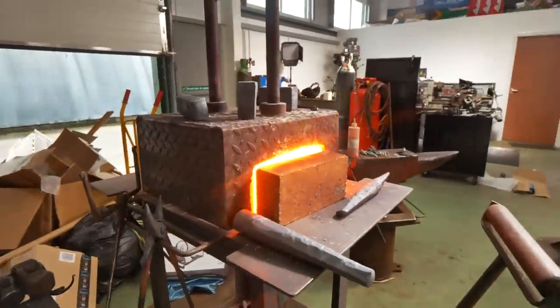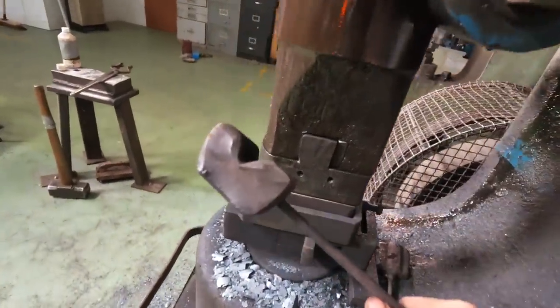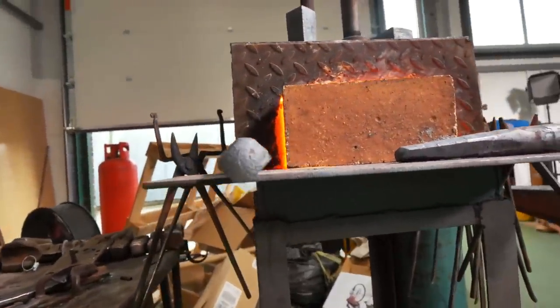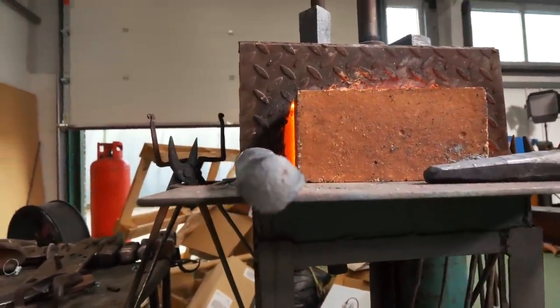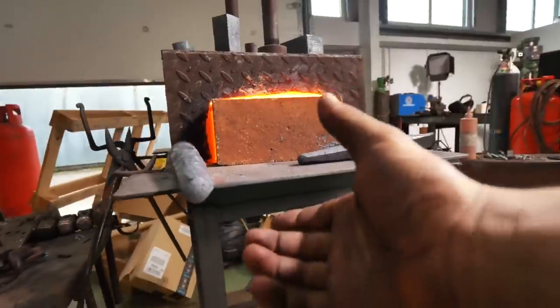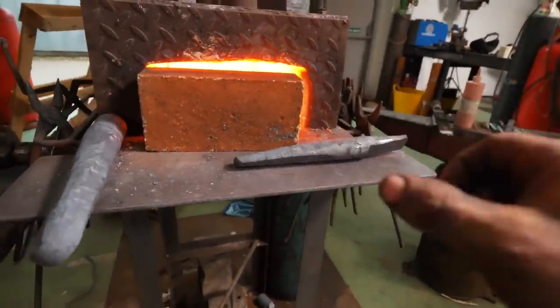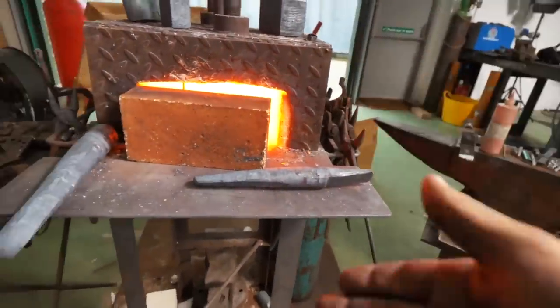As you can see I have this stuff really, really roughed out. It's difficult — I don't have the right tools. I forged a square taper, then flattened off the back in the V swage. Over here I forged a slot punch on one end, and then a starting drift — it starts a lot more rectangular on the tip so that once I punch a hole I can go in with this drift. Obviously it's going to get cut in half. Those three tools are going to require some angle grinding so I can get them to where I need to be and hopefully they'll work to get the eye of this axe where it needs to be.